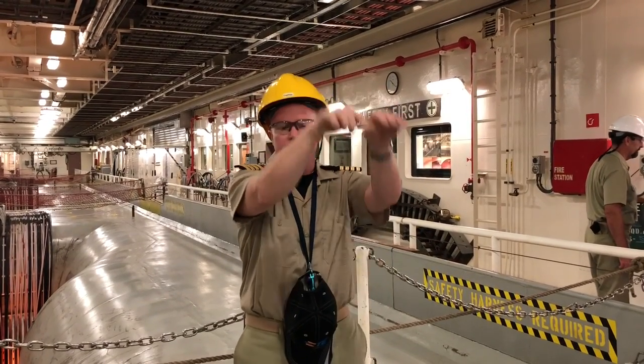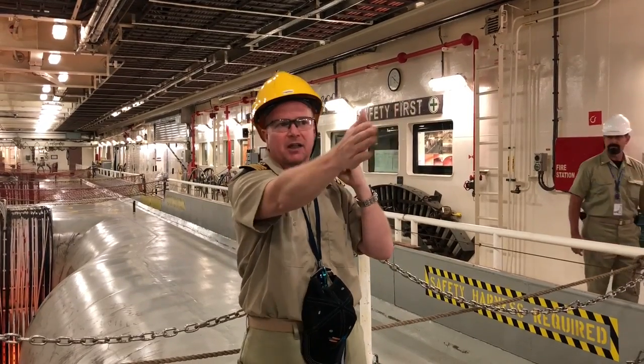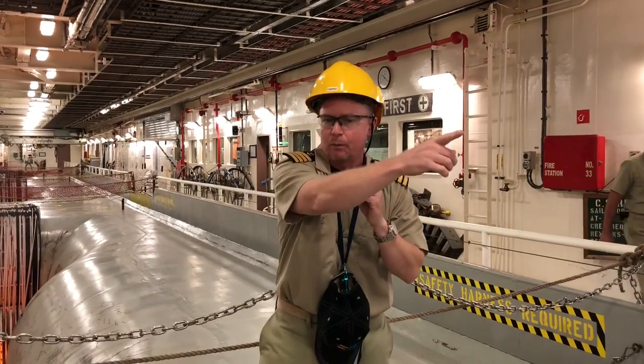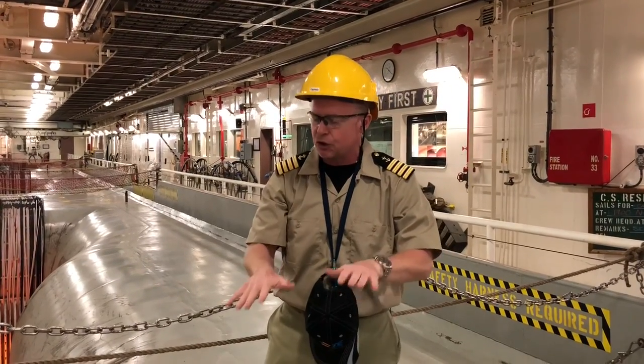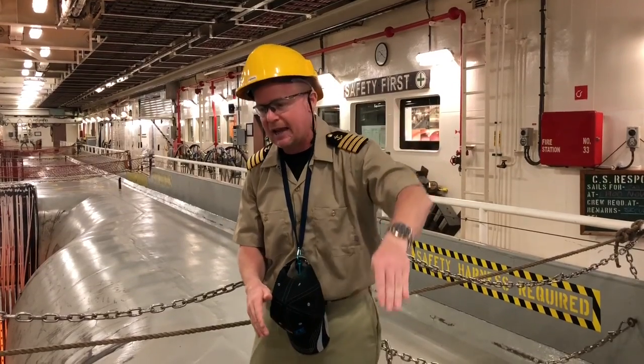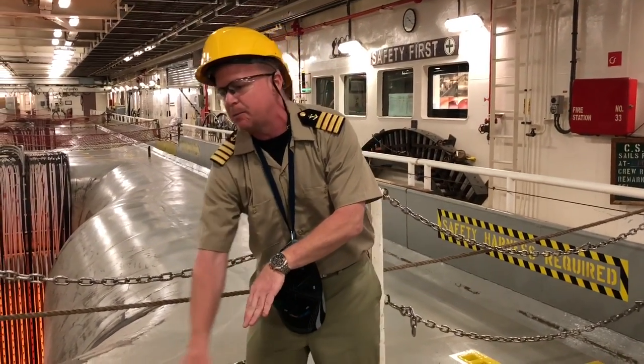We have a wire that tows it. It goes down to the bottom. And then at that point, the same thing, everything gets set back. The cable's still going off that sheave, but now it's going through this plow that we're pulling behind. And then the plow guys control it and bury it and get the burial. So now we're laying, but it's going down to the bottom, into the plow, and then through the plow share, and as it's coming out, it's buried under the water.